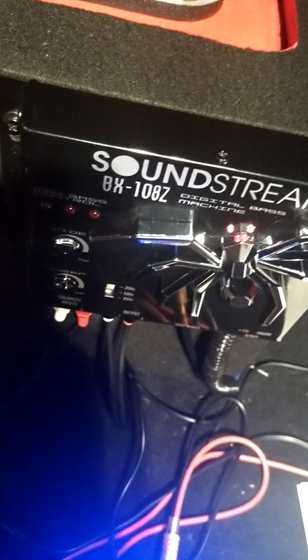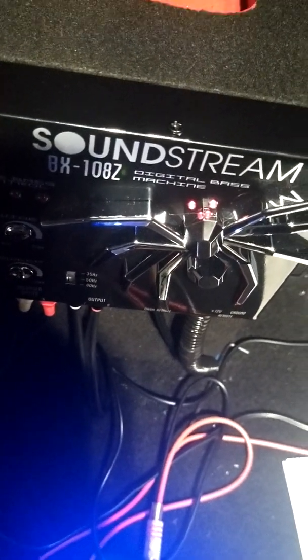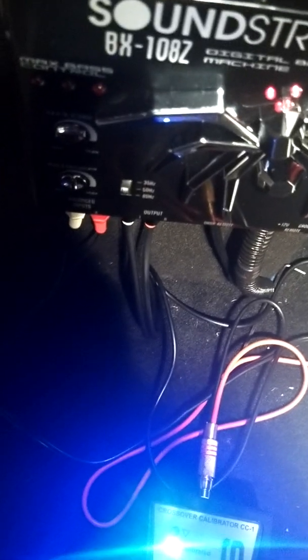And there you have it. I have now set my low pass crossover to 80 hertz and below, and I've set my infrasonic filter to 20 hertz and above. So this amp is going to be capturing frequencies from 20 to 80 hertz and putting it out on this 10-inch sub to the best of its ability. If that's not working out, I'll take this and restore some of that lost 40 hertz signal and bring up the middle. And that's it guys — that's my setup.